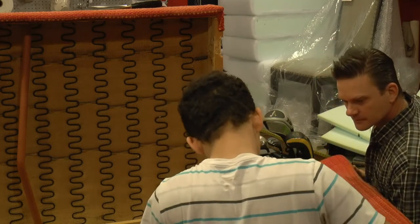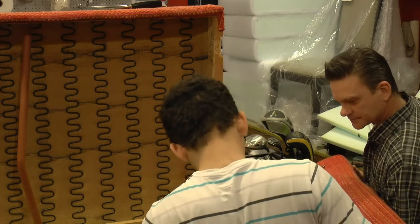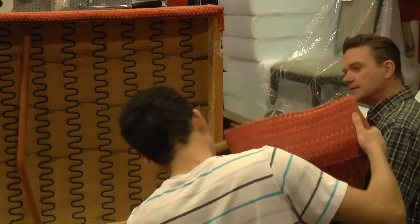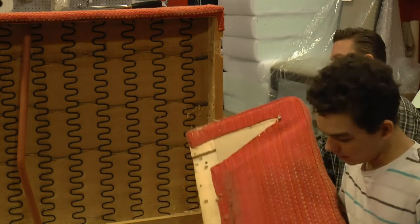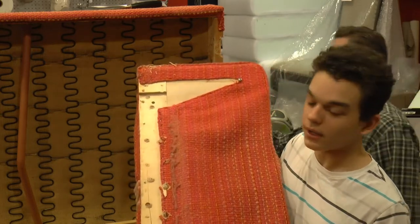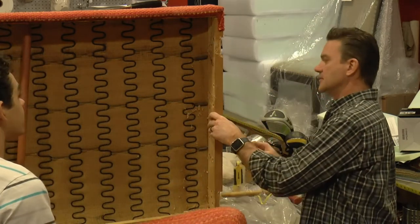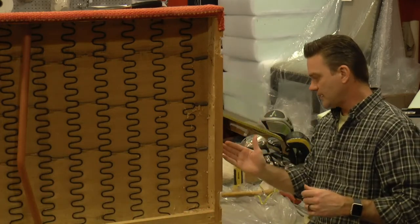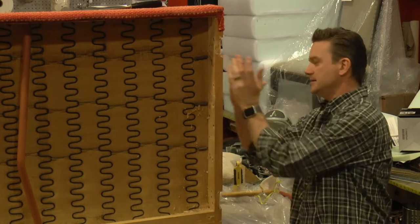Look at that - this thing's still holding on. They completely overdid it, and it caused cracks right here. Wood can only take so much. We're going to try to mend the wood as best we can, but it's going to be strong - stronger than they had it, actually, because they damaged it by putting in so many dowels. We're going to put some glue in this huge crack and clamp it down to bring it back the way it originally was.